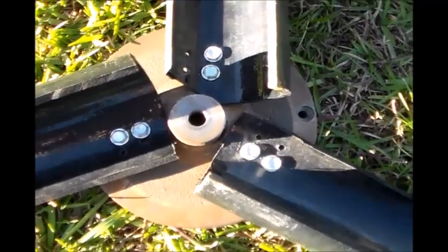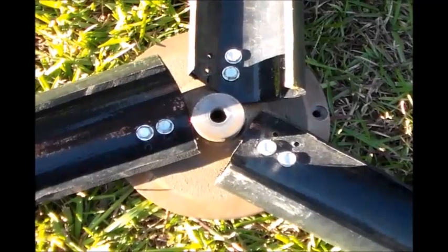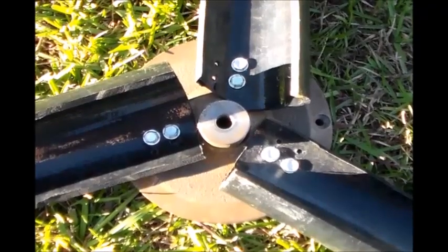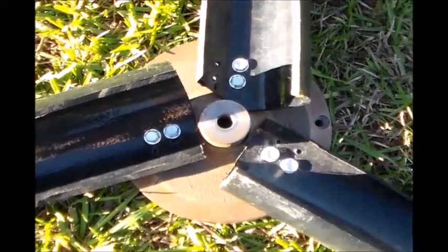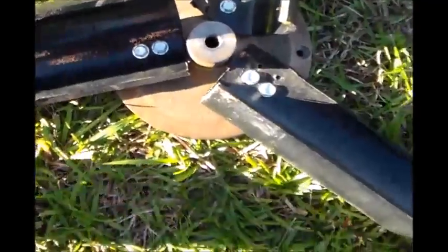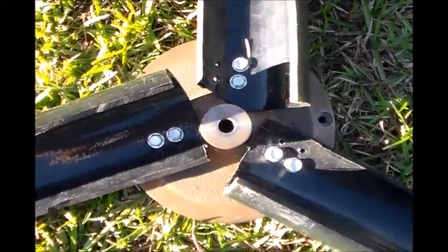The flywheel though, hopefully it won't give me problems. My treadmill motor is a clockwise rotation motor and this flywheel has left-handed threads, which means if you turn it to the right it's actually going to loosen, instead of turning to the left how a normal screw would loosen. If it gives me a lot of problems, I was just going to drill right through this and through the motor shaft and put a pin in there. But I'm going to try to use some thread locker and see if I can get it tight enough where it hopefully won't back out.